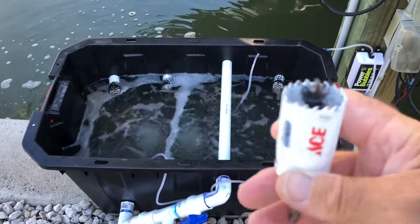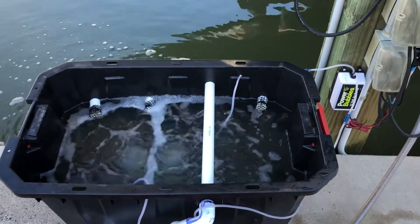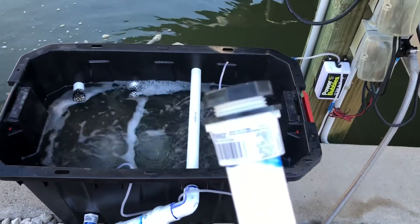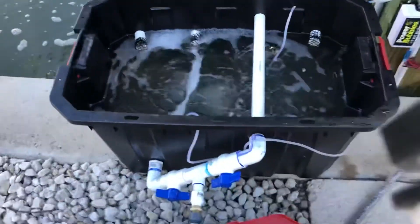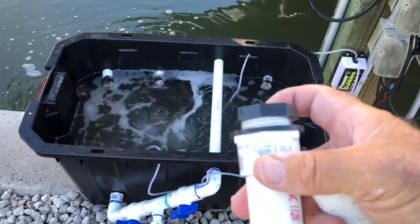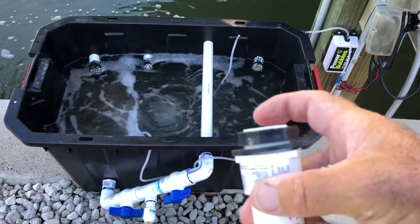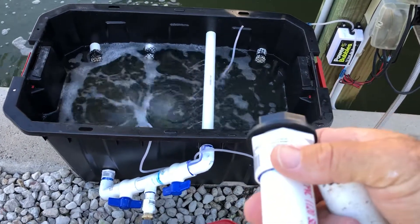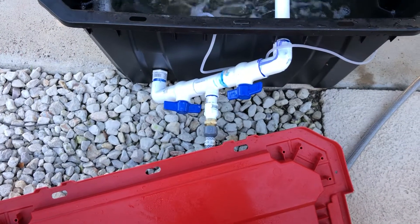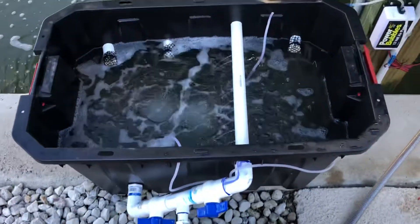The key to this is a simple two-inch hole cutter — you can see it just fits perfectly, really snug on those drains and on that pipe coming in from the top. I also bought a gasket fitting at Home Depot where you can put a set of threads through the side of the Husky box and screw in to get a watertight seal. I'm using that on the bottom so no water is escaping from the bottom feed.